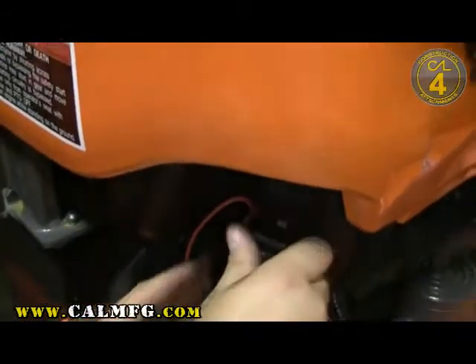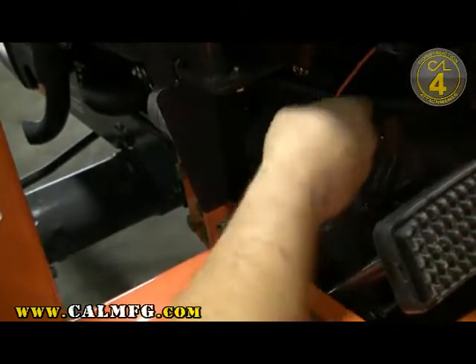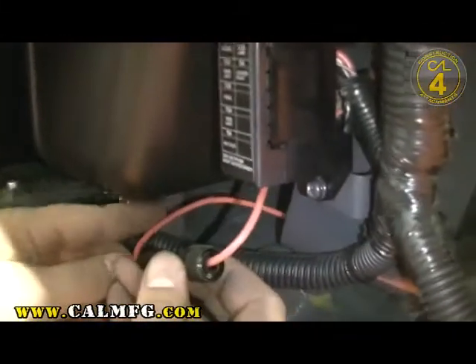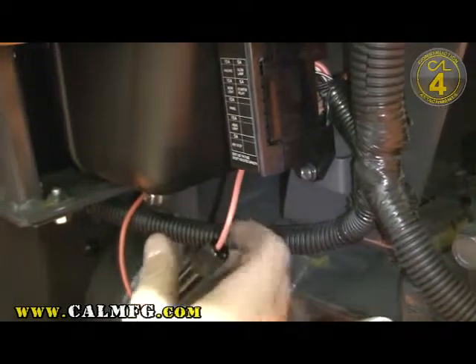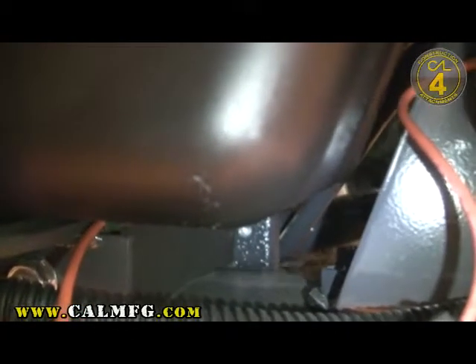Now it's time to reinstall the fuse box. I'm leaving it hanging out to the side of the tractor right now — I taped it off while we were working on this installation. This is going to run back through. I want to make sure that you pull enough of that black wire over here that you can leave this fusible link right here accessible, so that you can check the fuse. I'm going to route the black wire back. Now that I know where the fuse box is, I want to route it towards there so we can get power to our back. You want to be certain to avoid moving parts the best that you can so that you get long life out of the wire, and as with everything else, we want to tie these wires off as we go and keep them as protected as we can.